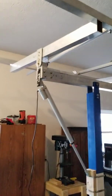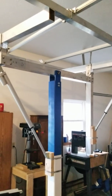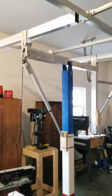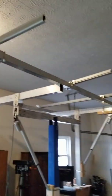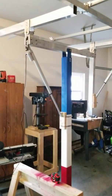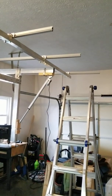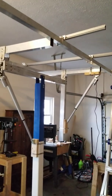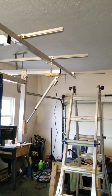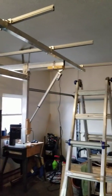Once the anemometer is in place, I'll test to confirm the flat/safe position works correctly before deploying everything. This will replace my existing wooden tracker — which can only hold two panels — with one that can hold all four of my panels, just over a kilowatt. If everything works out, I'll probably put up a second and maybe a third tracker to have quite a bit of power coming in and get close to going off-grid. This frame should handle panels up to 300 or even 350 watts, since 270W, 300W, and 350W panels aren't much different in size.